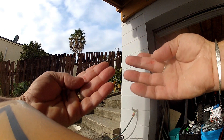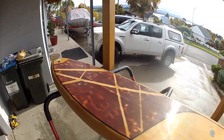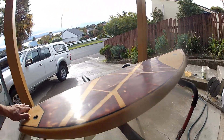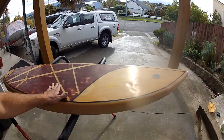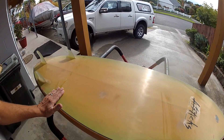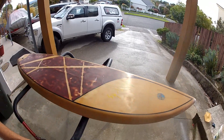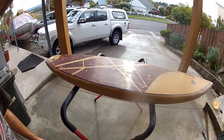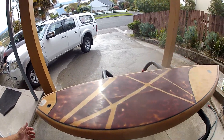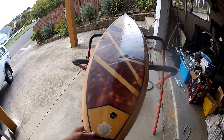Fast forward five hours of sanding and I've actually sanded through my fingers. Here is the board done — sanded basically three times: 400, 800, and finishing on 2000. It's nearly shiny — you can see it in the light. All fairly smooth and nice. I sanded to 2000 grit because I'm hand polishing. If I'd used a machine I probably would have only gone to 800 and buffed the rest out with a compound, but by hand, 2000 grit is it — half polished, half not.